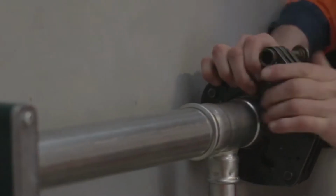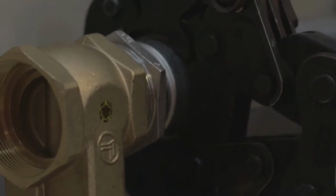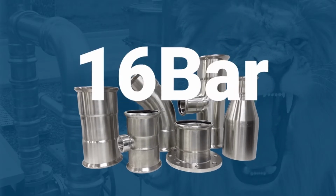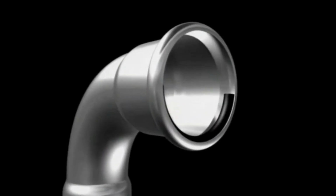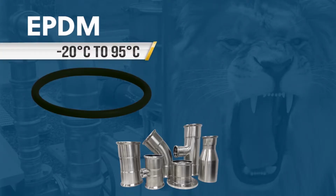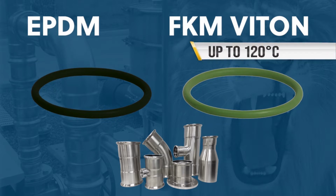You can now experience the faster, quicker and easier installation, no hot works, no consumables and consistency at every join. Europress Supersizes are suitable for pressures up to 16 bar or up to 25 bar on approved applications. All fittings come standard with EPDM O-rings, which is suitable for operating temperatures from -20 degrees to 95 degrees. There is also the Viton O-ring option available, which is suitable for operating temperatures up to 120 degrees.